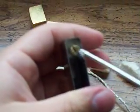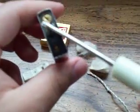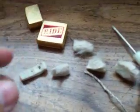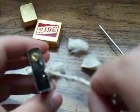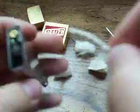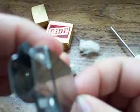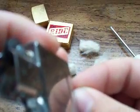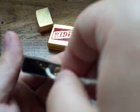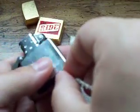Okay, so now the 5th rayon ball is behind the tube. It's very, very tricky to get out. In this case, I can see the hole, so I don't really need to mess with it. But that last one, you really want to wedge behind the tube where your spring and flint is. But when you get to this point, you would push your wick down very simply all the way through to that hole. Now, it's a tight fit. So this is where the tricky part is. What you want to do is, it's going to be hard to show you here, and this could take a long time fiddling with it, but you want to push a little bit through.